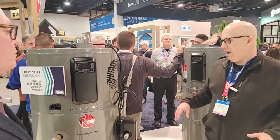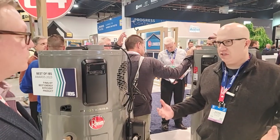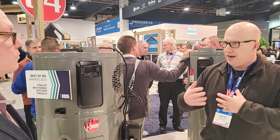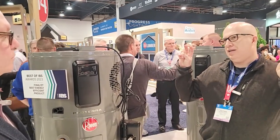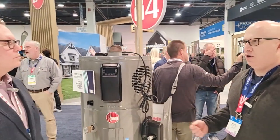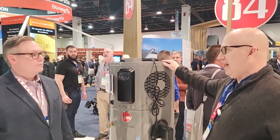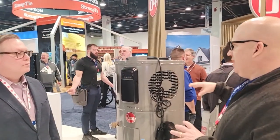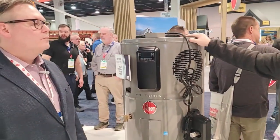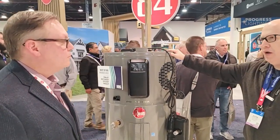One of the challenges we have — and you mentioned something very important — is load management on the house. If you're designing a new house, there's a lot of pushback on bringing extra power to the house or increasing load because it costs a bit more. But the retrofit cost of upgrading the panel later is much more expensive. Electric is the way of the future — if they have gas right now, don't de-future-proof the house. Future-proof it and give a little more space on the panel so you can upgrade these appliances later.